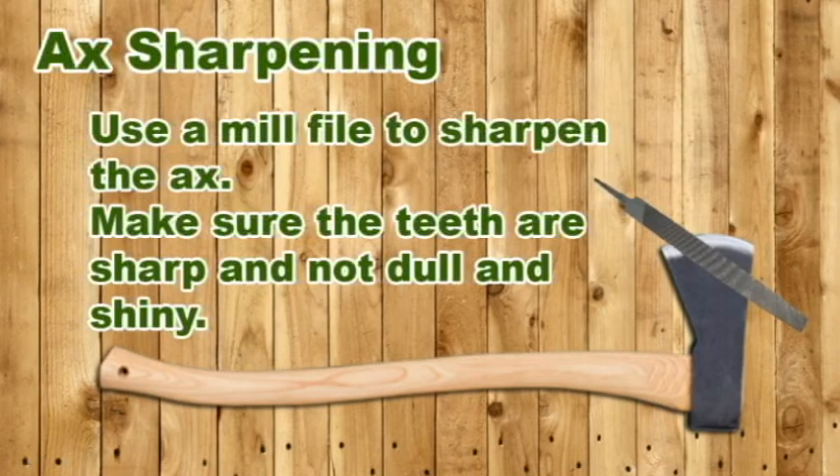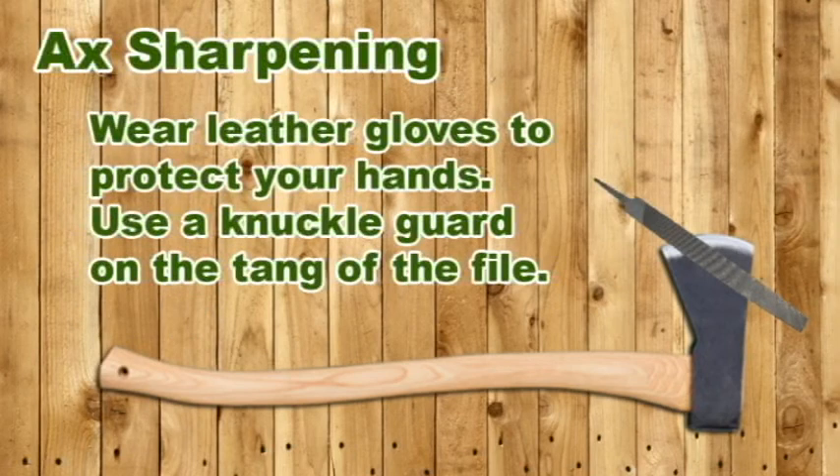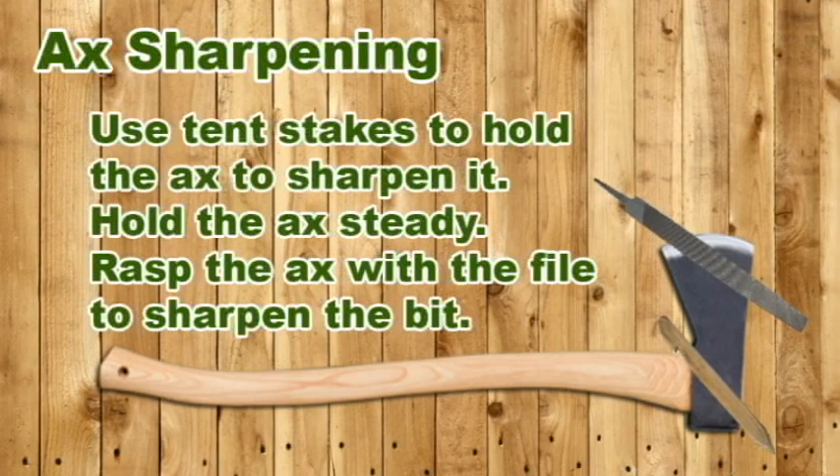Sharpening the axe: Keep your axe sharp with a mill bastard file that is 8 or 10 inches long. The lines across the face of a file are its teeth — they angle away from the point or the tang. A sharp file will be flat gray, not shiny. A silvery shine means that a file has broken teeth and won't work very well. Wear leather gloves to protect your hands as you sharpen an axe with the file. Make a knuckle guard by drilling a small hole in a 3-inch square of leather, plywood, or an old inner tube. Slip the hole over the tang of the file and hold the guard in place with your file handle. Brace the axe head on the ground between two wooden pegs or tent stakes and a log about 6 inches in diameter. Place the file on the edge of the blade and push it into the bit, using enough pressure that you feel the file cutting the axe metal.